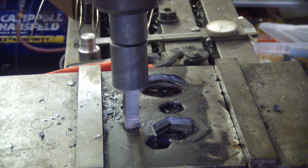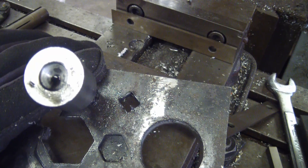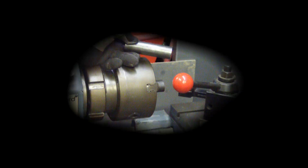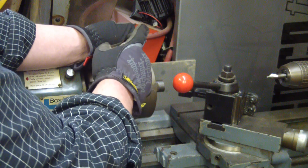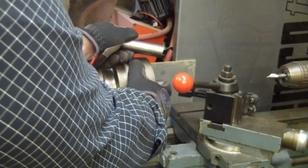That's pretty much all there is to it. And we're through. There you have it — that's the simplest rotary broach tool you'll ever see. First up, we're going to chuck up these rounds in the lathe. This is going to be the broach holder with the perfectly centered divot for the ball, and the drive with the offset pivot.